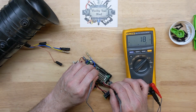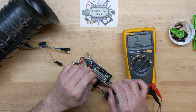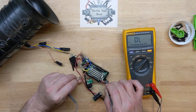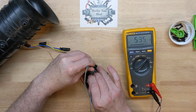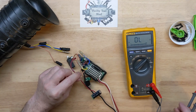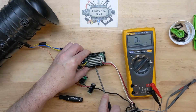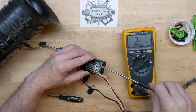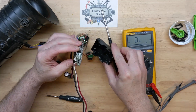Now as we separate out we still see low ohms across, but some are lower than others. Let's check the brown one — it had the lowest, almost like a dead short. The others have about 500 ohms. That one is actually a dead short back to the positive and negative rail. So let's go ahead and remove the controller board. Denny already took a lot of the potting off around the fuses and leads, and it's cleaned up pretty well, which saves a lot of time on video.